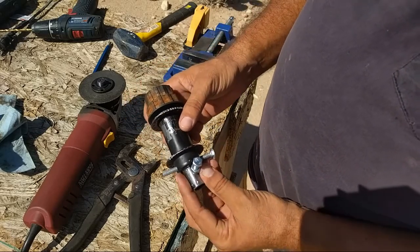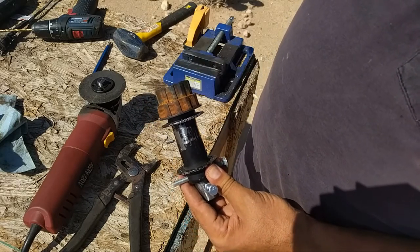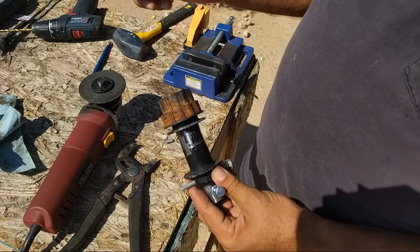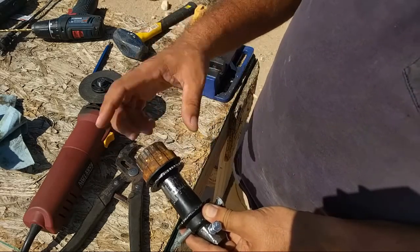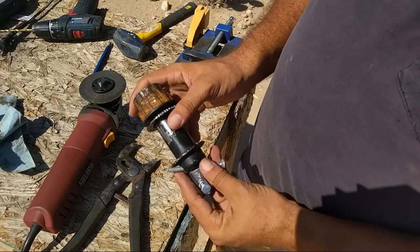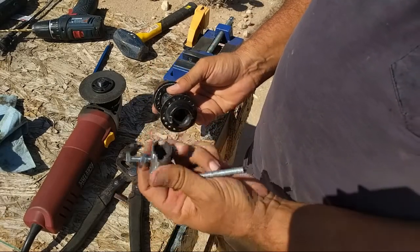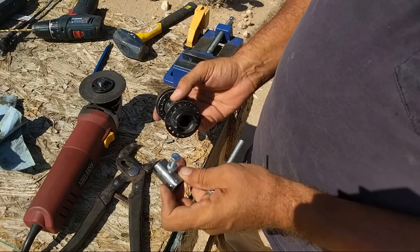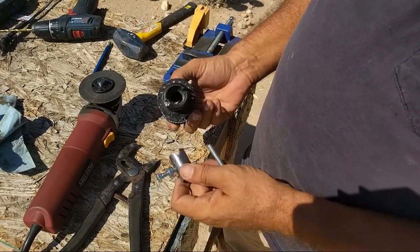Okay, so the way it's set up, my rear wheels on Turtle are actually front wheels off a bicycle. I saved the rear wheels for this. The front wheels don't have this, so I took out the bearings on the other wheels. I'm going to do the same slot and this kind of a setup. This will lock the wheel to the axle so it doesn't spin. Then I turn the axle and the wheel turns with it. I think that's about as simple as it gets.